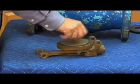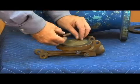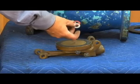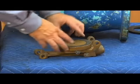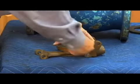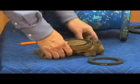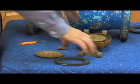Remove one bolt. Underneath the bolt would be an O-ring, right there, our disc retainer. Underneath there you would see one of possible 3 washers. You may see 2 grays and 1 red, or some combination of those 3. And then a check disc, which comes out of the disc holder, just like this. Okay? So those are the parts in the check mechanism.